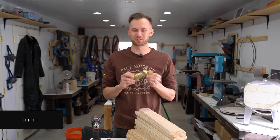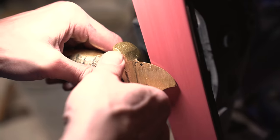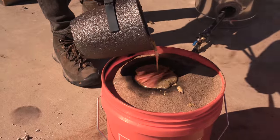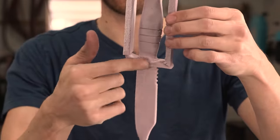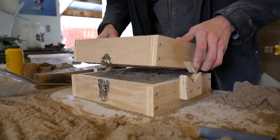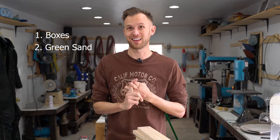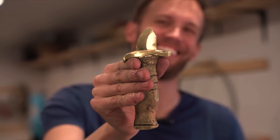Not long ago, we did a casting test with some melted metal in our new foundry, and we got this fantastic knife. It's not a perfect result. This was from casting into dry sand using lost styrofoam, which is not necessarily the best way to do anything, especially small, delicate parts. So we want to move on to being able to do green sand, which is a sand that holds its shape without the master form inside — it just has an empty space in there. So today we got to make some boxes, make some green sand, and then do some tests trying to make some better castings than this totally successful, but also totally failed knife.